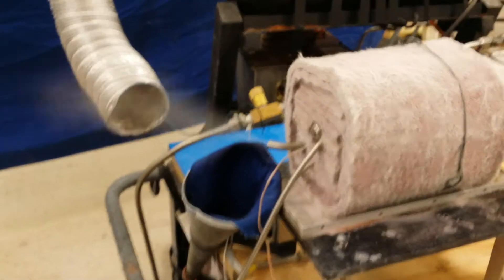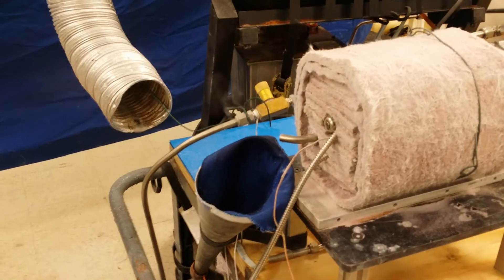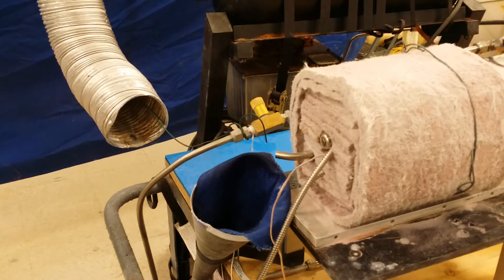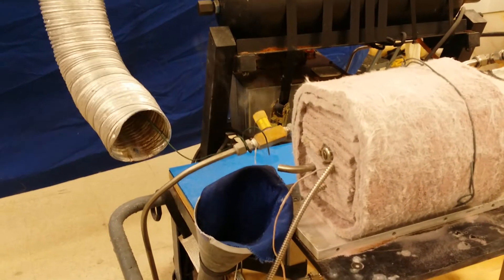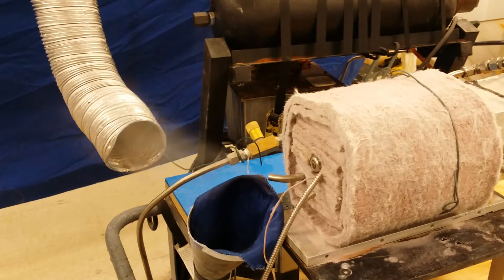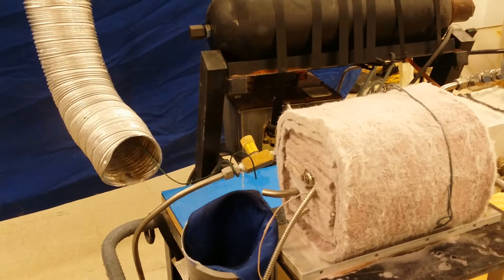You can see the explosion. The water that comes out of here is oxyhydrogen combustion that occurs inside this thing. Of course, when oxygen and hydrogen combine, the result is water. You can hear the bang and the click of the bang. The click is the injector. The bang is the impact of the water injection.